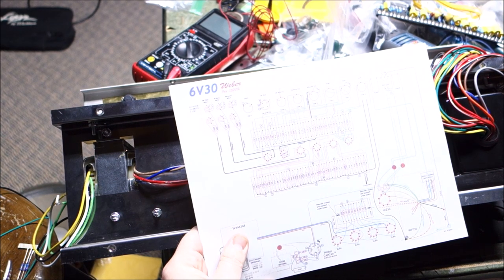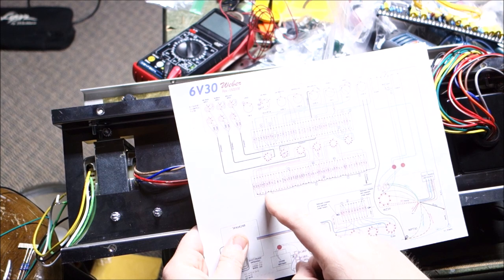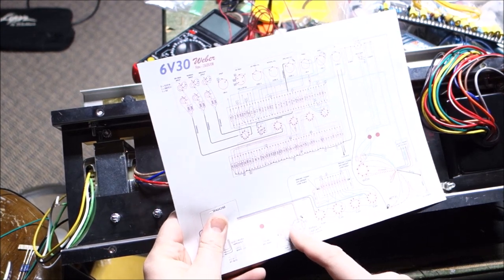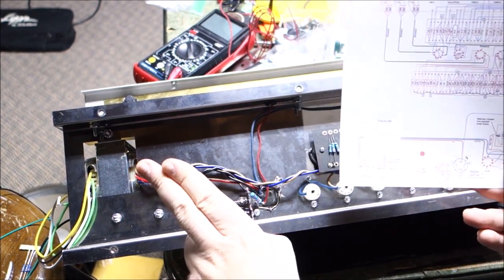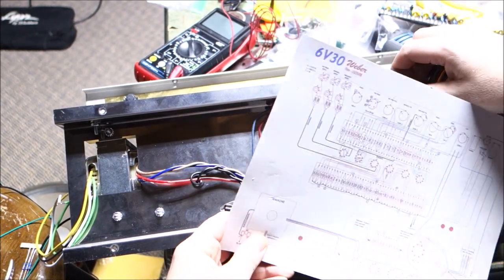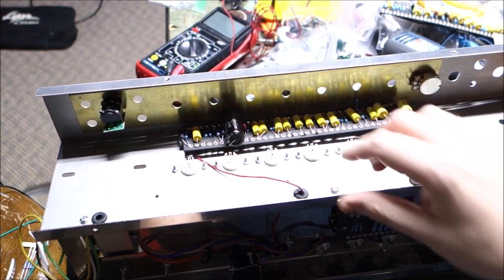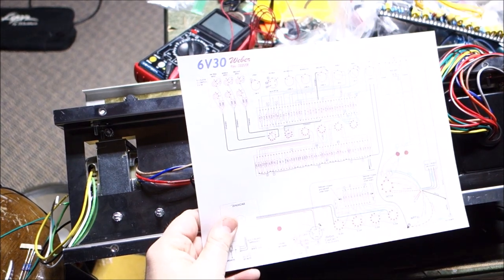The second thing is you'll see we have points C and D. Point D is only up here, and point C is all across here. So I'm going to need to construct a rail across the back of this board for the power rail C. A is down here at the can cap, which in the picture is pictured sort of vertically. You've got to rotate it 45 degrees to get the reality. But we're making progress. I have a line running, this red line, up there and underneath to the A spot on the top board. The board is detached, so I can just flip it and work on it. The A rail is connected. I'm also going to need to do the D rail, which would be the most logical next step.